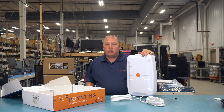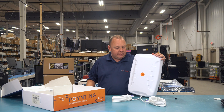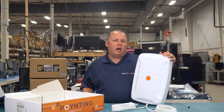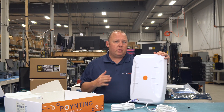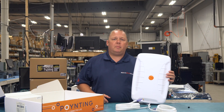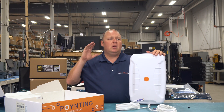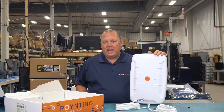It is a directional antenna — not omni-directional — so you do have to point it at your target location. Directional antennas can cause some problems for customers with multi-modem solutions. For example, if you have a Transit Pro with two cellular modems, each needing two cell antennas, you could technically use this for both modems. However, if you're using two different cellular providers, the cell towers might be in different directions, and since this has to be pointed, that could cause problems. You may want to look at an omni-directional or roof-mounted antenna if directional isn't for you. But for top performance in rural, home, agriculture, or fixed building mount scenarios, directional is really where it's at — once you dial it in, it just functions perfectly.